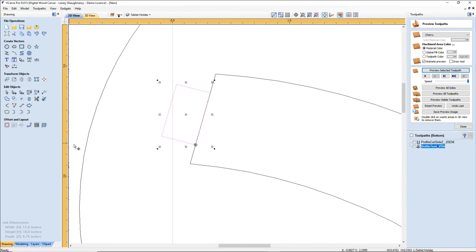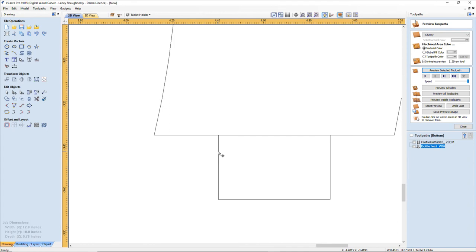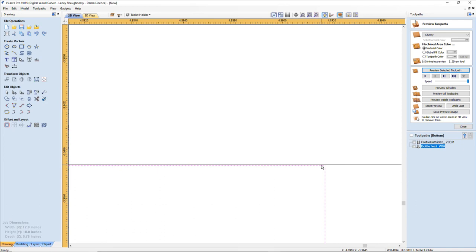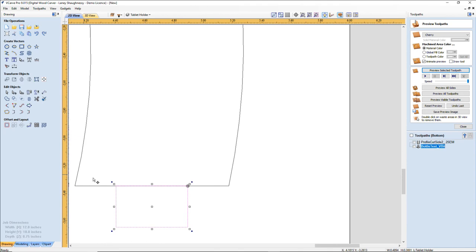And I am. All right, so now this one was doing the same thing, which means that it was not quite level. You can see the more we zoom in, that's about the max I can zoom in, but you can see that air gap. And it's very important, very crucial. I'm going to move my pivot point out of the way for a minute. It's very important that we're making contact, that when we're cutting and things, we're in the line where we're supposed to be. When you see things like those lines that I saw, that let me know right away that there was something wrong.